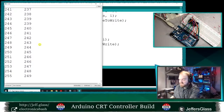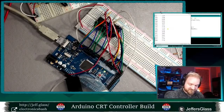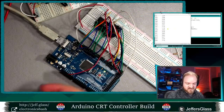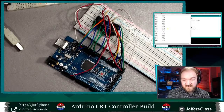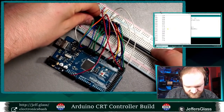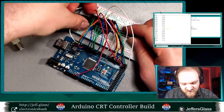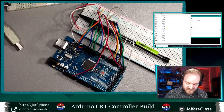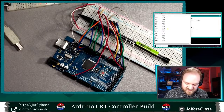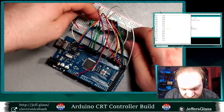One thing we might try, since these are sort of new old stock, is using a different chip, another 6264, just to eliminate that as a variable. I don't think it's going to be that. Very carefully take this out with my high-tech mechanical pencil tool. I've been meaning to buy IC remover pliers, which have little hooks on the end, so you can pull the chip straight out instead of levering it out and risking bending the pins. But I don't own a pair yet.